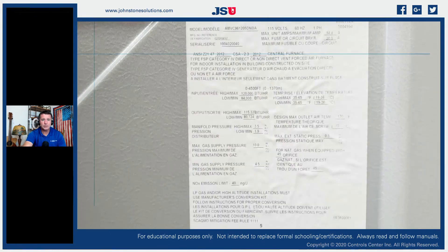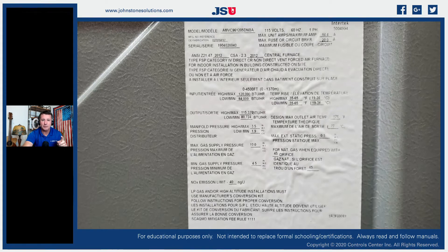If I measured temperatures on this piece of equipment and found a 70°F return and a 140°F supply temperature, that gives me 140 minus 70 — a 70° temperature rise. I want to look at the installation manual or the certification tag on the inside of the equipment to find the proper temperature range. This particular one shows a temperature rise between 35° and 65°F. A 70° temperature rise is above that range, meaning I'm going to end up with a heat exchanger failure. That 35–65° range gives me a 30° window. To find true maximum efficiency we'd test the flue gases with a combustion analysis — for example, how close am I actually getting to a rated 96% AFUE.